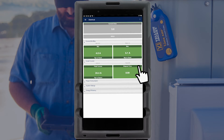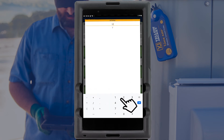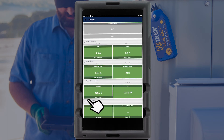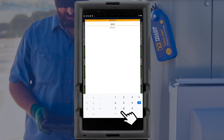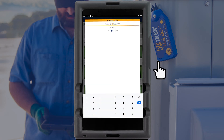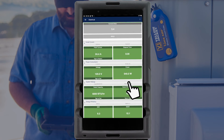To measure the system's power consumption, tap the Voltage Reading box and enter the Rated Capacity and Energy Efficiency Ratio or Seasonal Energy Efficiency Ratio for the system. The actual EER and approximate SEER are calculated and displayed for determination of overall system efficiency.